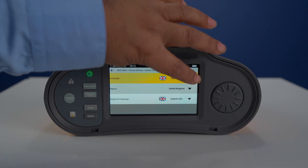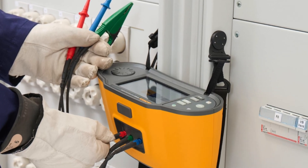The 1670 series also supports 12 different languages, regional standards and local dialect text inputs, making it super versatile. You can also set up projects, collect circuit metadata for reports and automatically calculate measurement limits. You can also connect to the 1630-2 FC or the 369 FC to view earth resistance or leakage current results from safe positions, linking measurements to the circuit under test. And for hands-free testing, you can use a 1670 mag grip hanging kit.